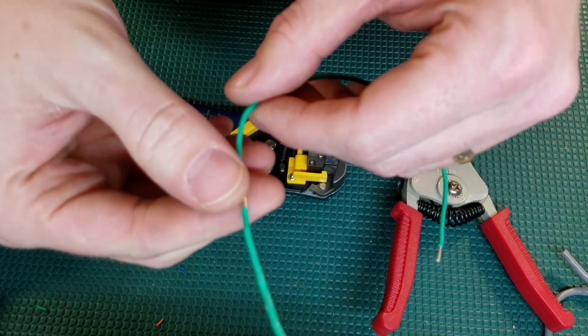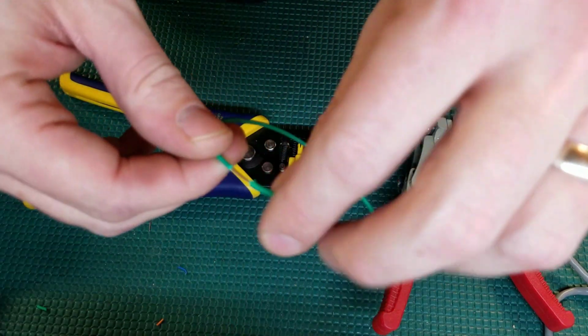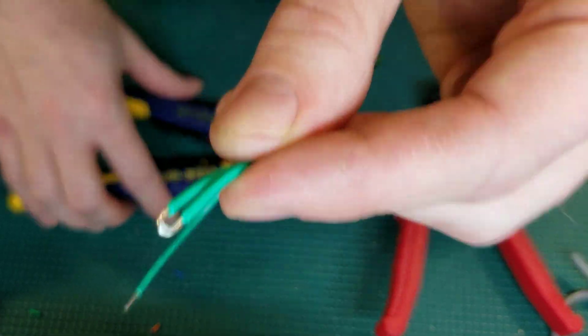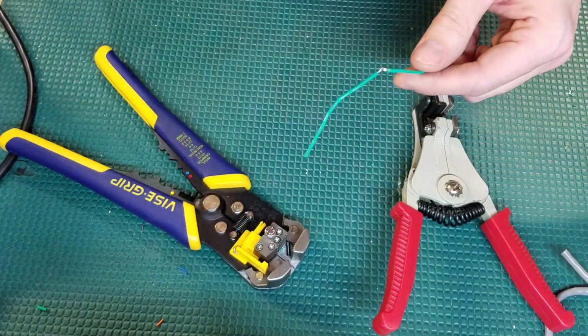So you see here, I just did one here where I did a middle crimp, which again, I think these work really nice as well. So now if you needed to take this wire, if you needed to bend it over and maybe get a terminal there on the end, you can do a middle crimp, and that works very well. So let's do that in crimp again, since I didn't get it working a moment ago.